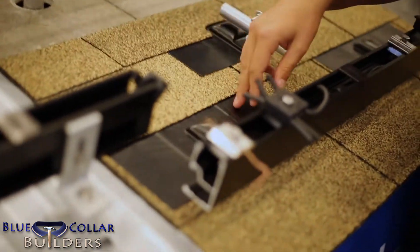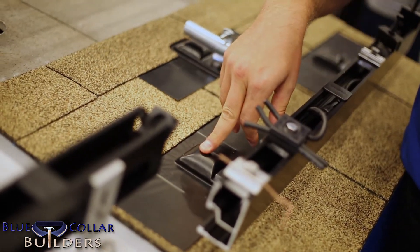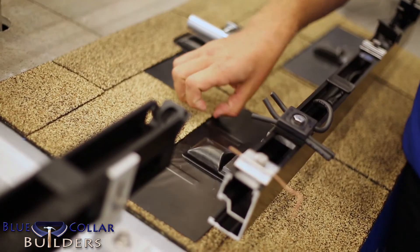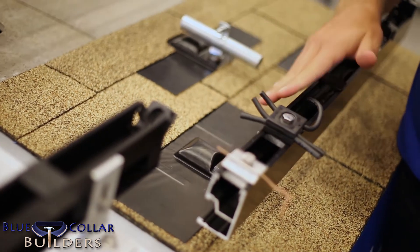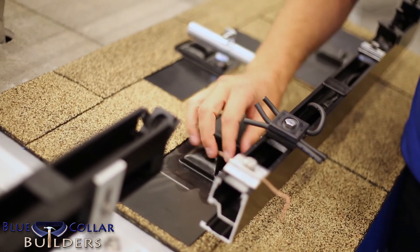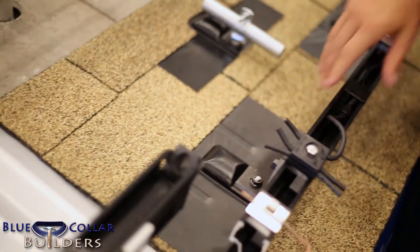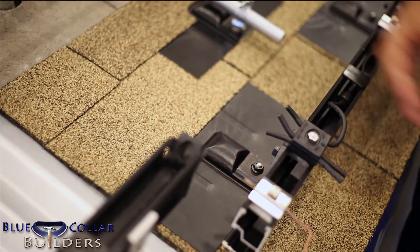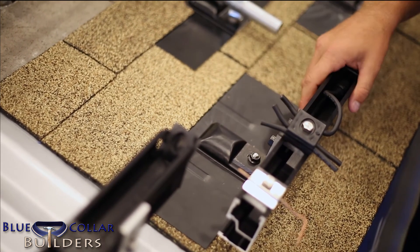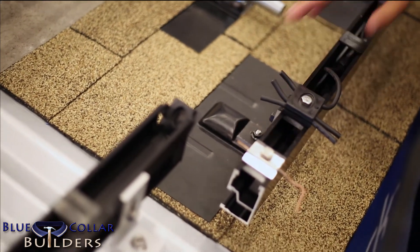The flashing is a full piece of stamped metal. There's one penetration underneath that installs with a 5/16 lag bolt. Once you have the base in place, you use a breaker bar to lift the shingle above to slide your flashing underneath. That flashes the penetration, and then you attach your L-foot directly to the top of the base and start running your rail. The main thing to point out is that there are no rubber components in the system — it's a full metal flashing, more traditional to a roofer's flashing than other solar flashings.